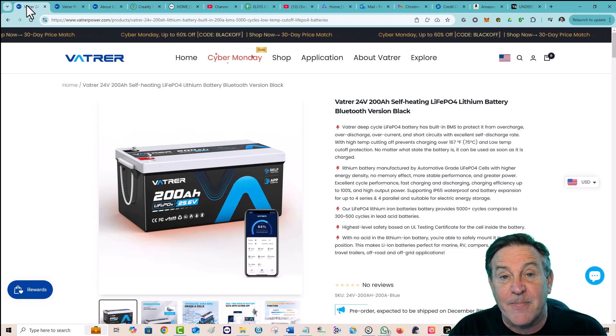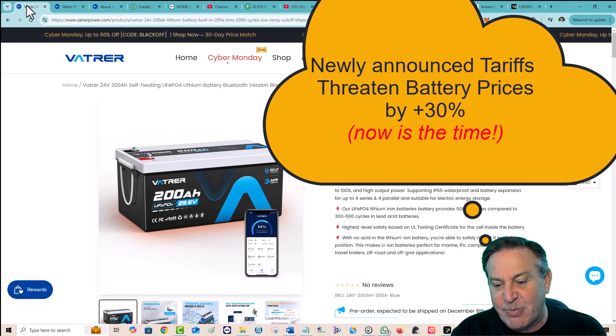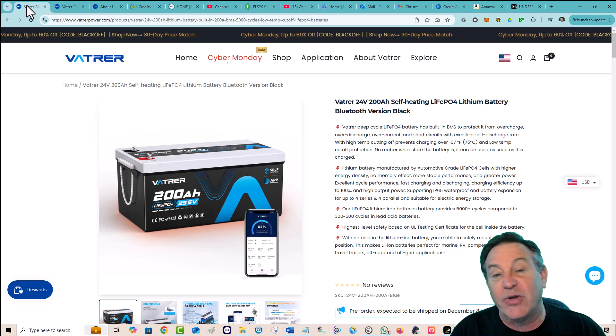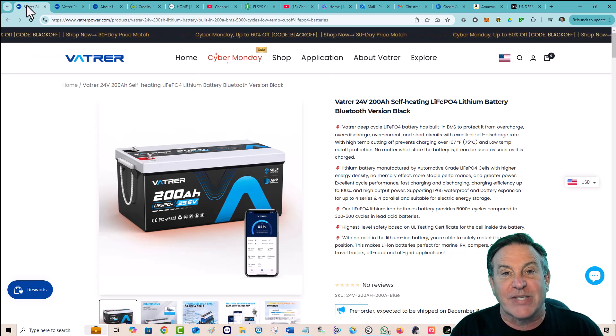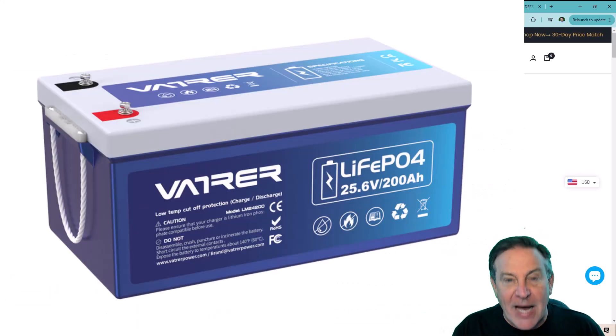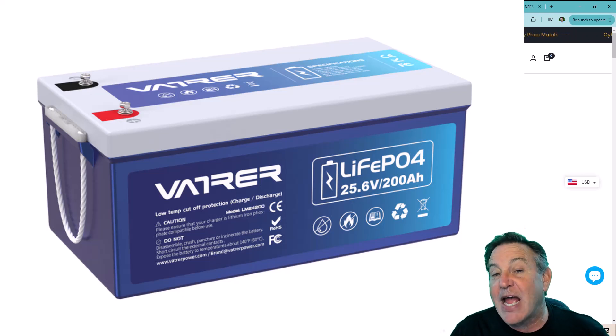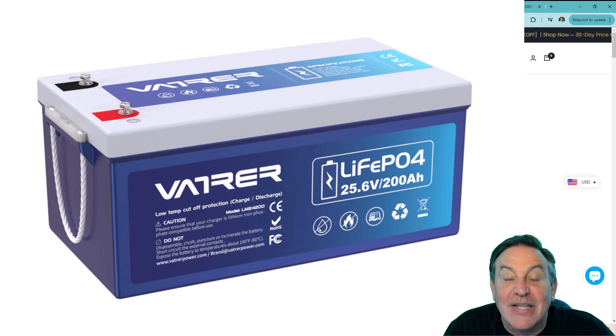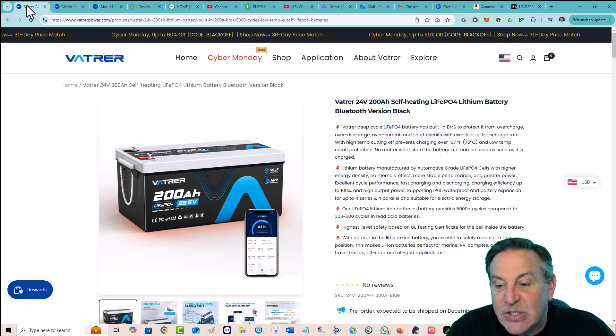Previously, if you had multiple batteries to build a system like this, you would have needed four batteries. Those were about $350 each, so $1,400 worth of batteries — and they would not be managed. You'd have to put balancers on everything, set up programs, and really know what you're doing. A battery is storage for a lot of energy. If you were wrenching on it and touched the positive pole to the negative pole, it would spot-weld that wrench to the poles. So you want to handle it responsibly.